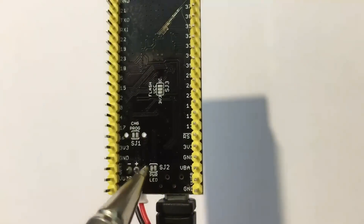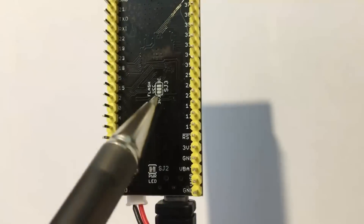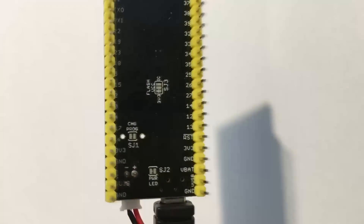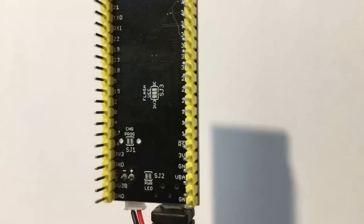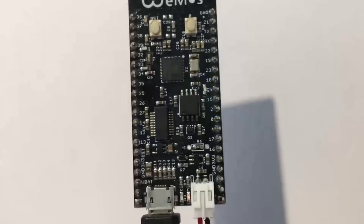There's a link to disable the power LED for minimum power consumption, options to change the charging current, and to change how you apply power to the flash memory. It's a pretty good board all round, very well designed.